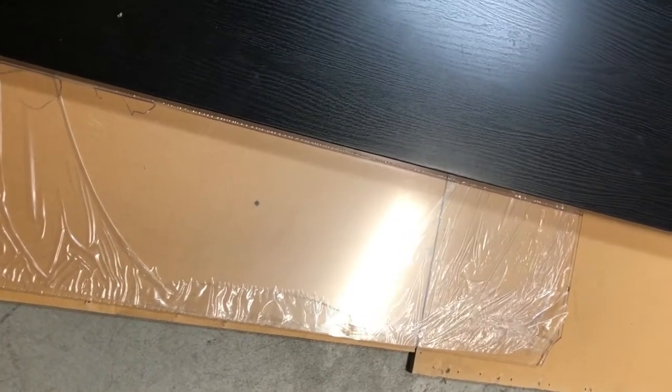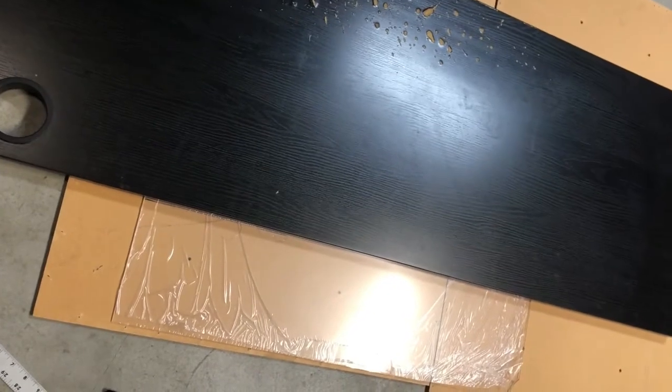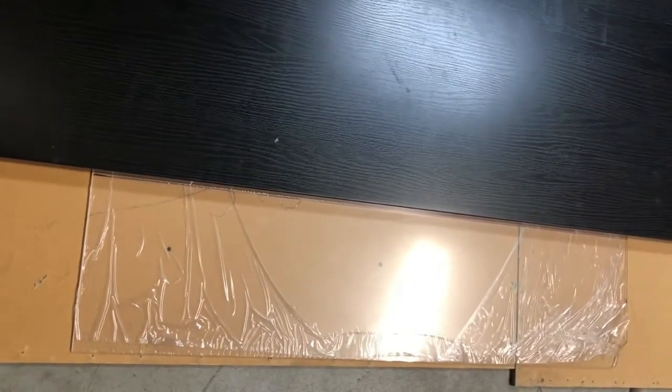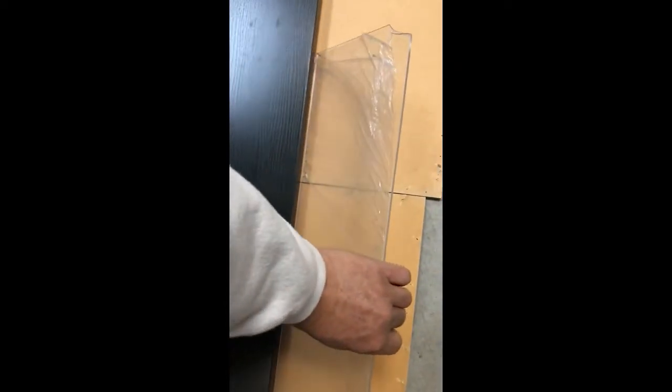In this layout, with the piece of wood on top, give about a quarter inch or one eighth inch of space between the wood and the actual scratch line underneath the perspex sheet. With your weight holding down on the wood on that line, reach out to the perspex material and pull it towards you to break it off right on the line.